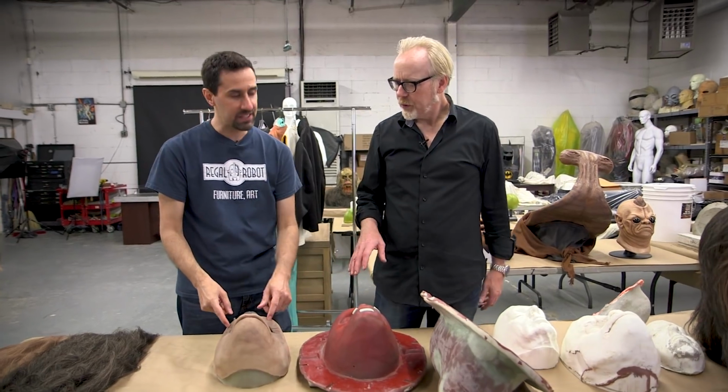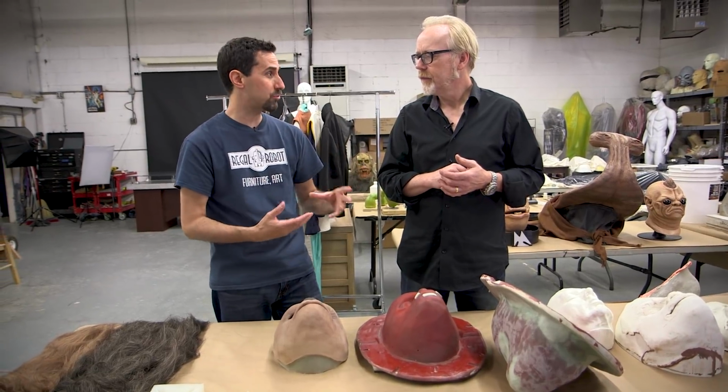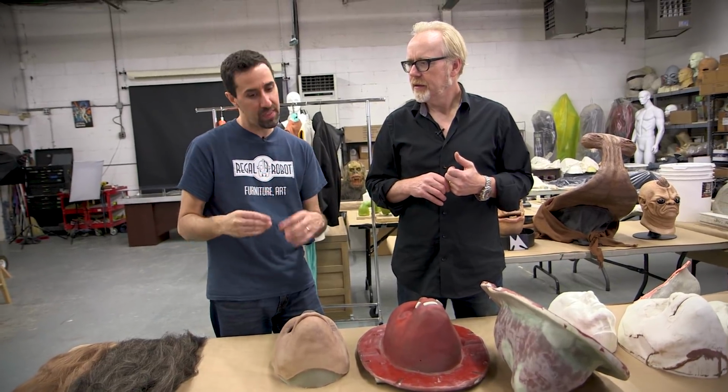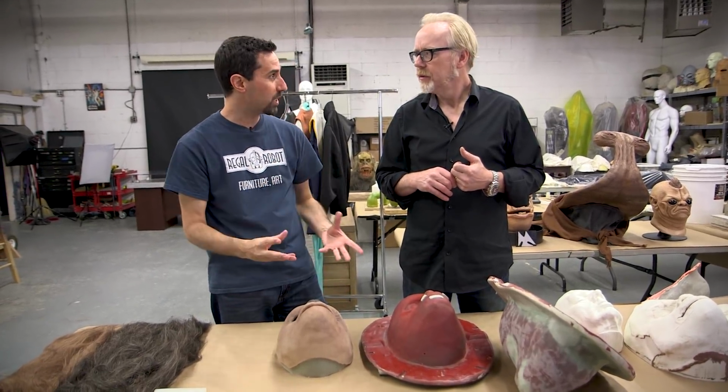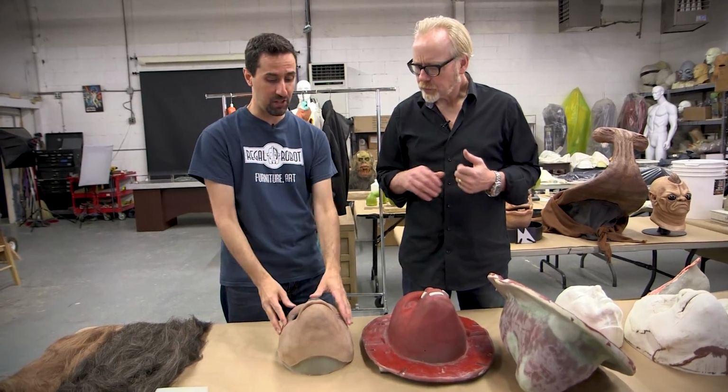Correct. So this is, I believe, Dragon Skin FX Pro. What we wound up with was a mix of FX Pro and an Ecoflex, I think 00-30 or 00-20, to get us a more soft skin, but still not one that would weep at all or leach any oil. We wanted something that was self-contained, and Smooth-On stuff was great for this.